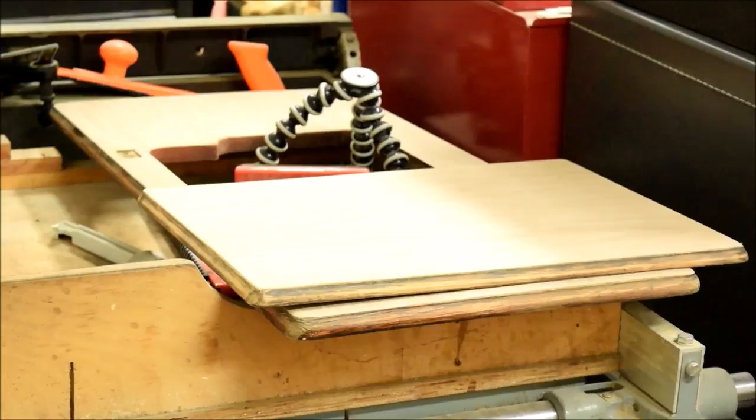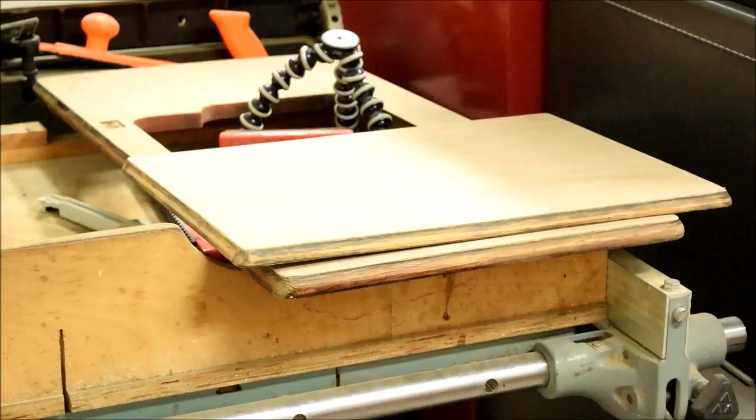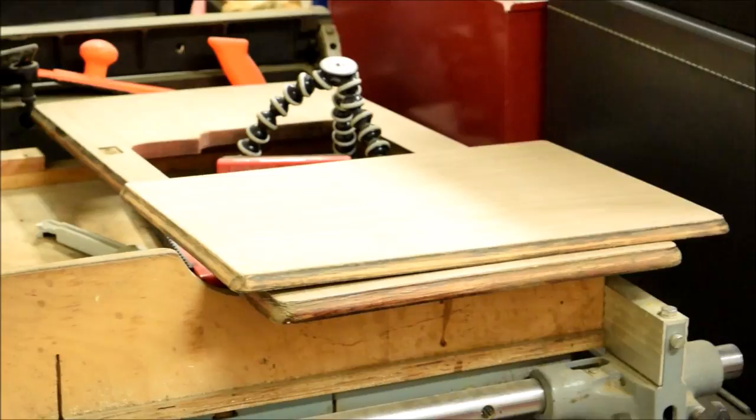So what I think I'm going to do is stain this, put a couple of coats of sealer on it, and then if we have to grain fill it we'll grain fill it with an oil-based grain filler. That way when we're sanding off the remnants, we're sanding off the sanding sealer and not the veneer — that's my thought process on that. But let me get ready to start staining some of this wood. Okay, let's stain the lid and see how it comes out.